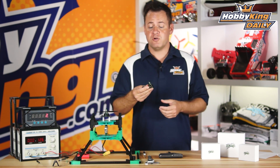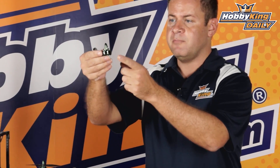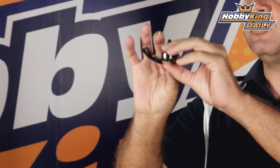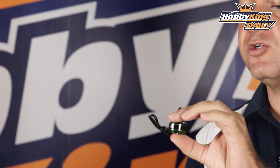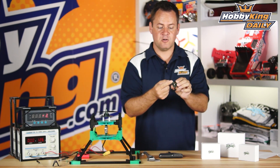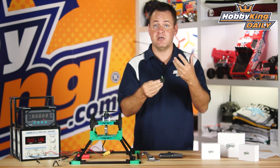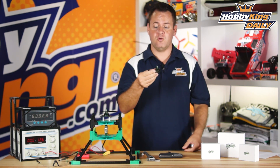Just to denote the Elite motors, we went ahead and anodized them — it's a little bit darker green. Another feature that makes the Elite motor is the design itself. If you notice on the bottom here, it's chamfered down and we've got a little bit taller stack. The reason for this is you've got almost six millimeters on the bottom, giving you ample room between your mounting hardware and the windings, so you won't have any problems with motor bolts going up into the windings.